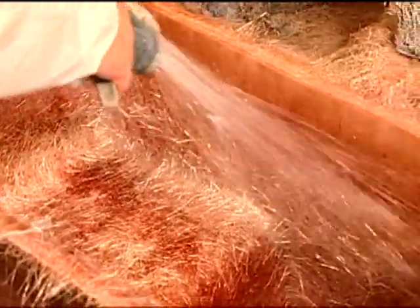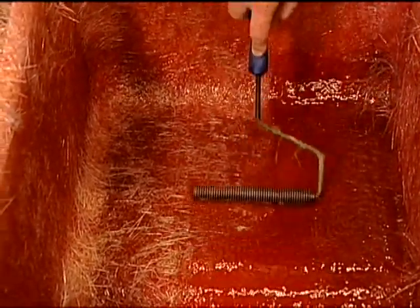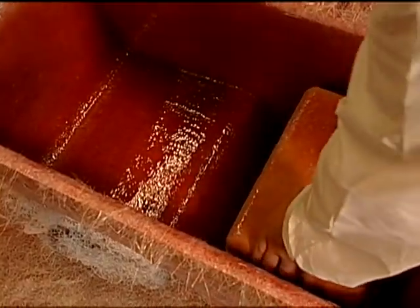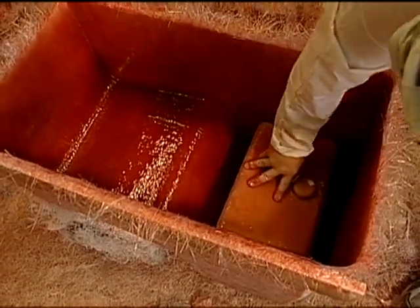Do we need to put a second application of fiberglass in there before we put in the bucket? What I like to do is get the first coat in, get the second coat ready, and lay it up again a second time with your part ready to fit in there. Roll it all out, then mush the bucket down in the bottom — that's going to make it one solid piece, fused into the part. You let it dry and it's going to be one part exactly.